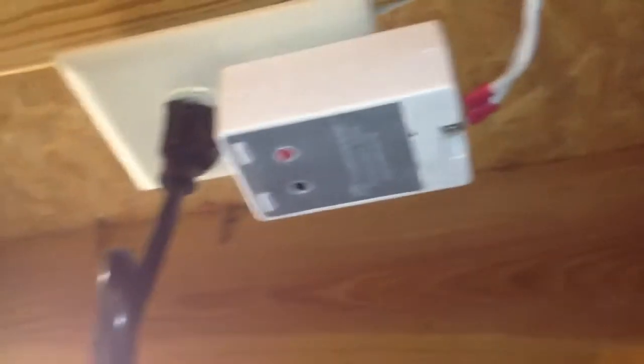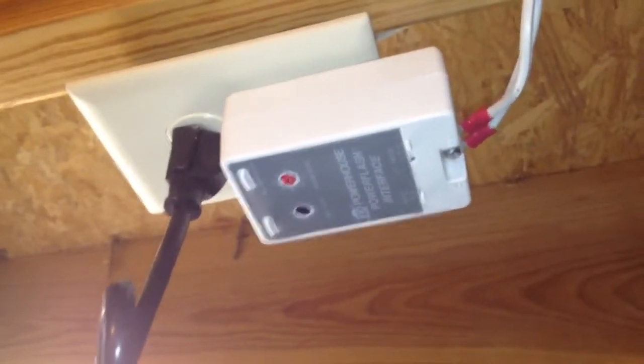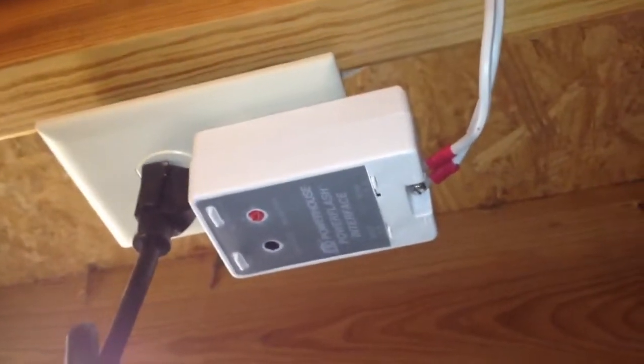You've got three wires in your smoke detector: black, white, and red. White is the ground wire, or the common. Red is the nine volt signal wire. So basically I've got the positive side of the PSC 01 connected to the red, and the common connected to the negative.